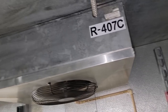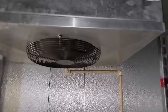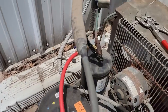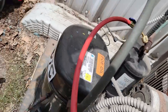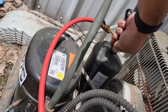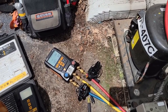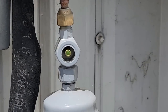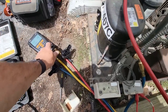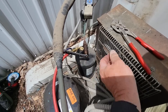So we've got the inside fan. Let's go ahead and see if we can start isolating stuff. My gauge says negative five — that could be because it was in a cold area and now it's in heat. But my suction came up. If we open this valve up, we are open and we're at 180. And I see refrigerant bubbling through there. Kind of an oddball one, to say the least. I backed it out when I did that, so I didn't shut it.